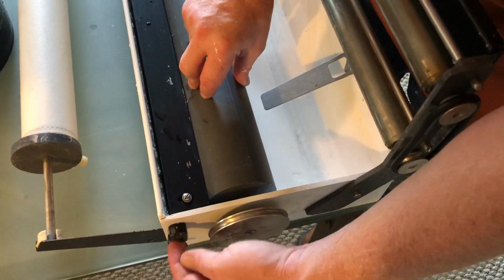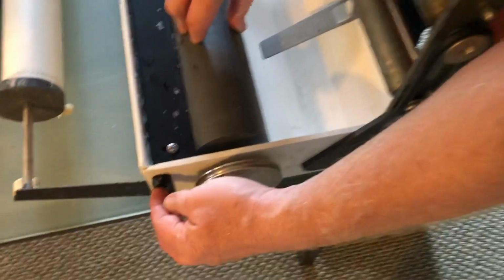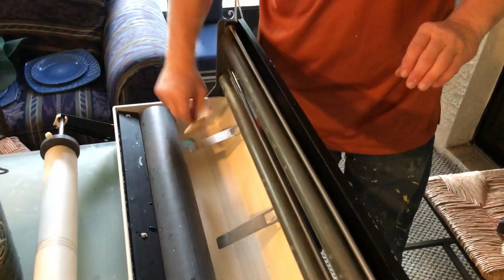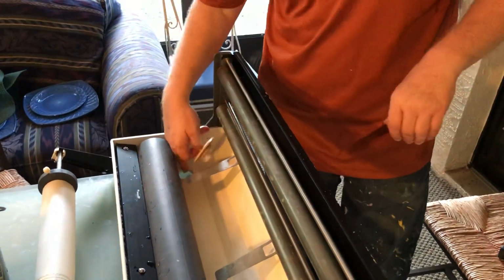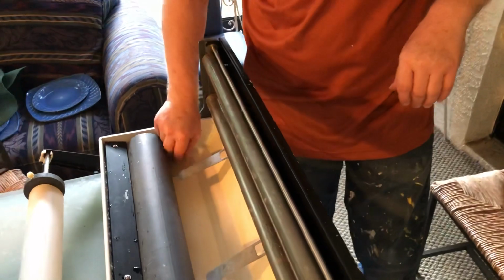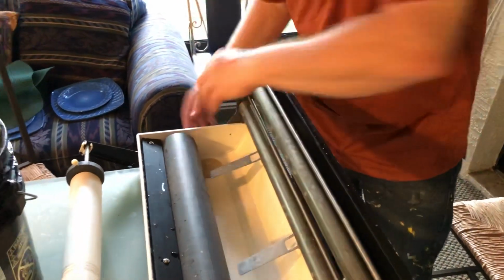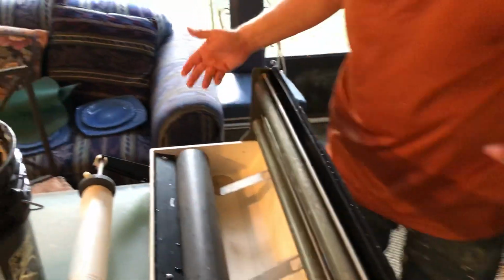And so the space in between my roller and this screed either widens or gets closer to the roller with the maneuvering of this gadget here. And that gives you the thickness of your glue. I added water to it, and so my machine is working. I have a stopper so that my glue doesn't fall out into the floor area. And so I think I'm ready to go.